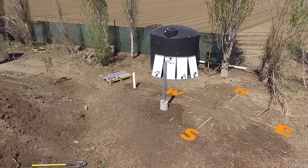We're ready to drop our well pump down our well. If you're installing by yourself, I recommend stretching out the drop pipe and pre-taping the wire and the low well sensor every 10 to 20 feet along your drop pipe, leaving some slack in between. That's important because poly pipe is going to stretch around 1% — over a hundred-foot drop it might stretch around one foot — so we want to make sure there's a little extra wire slack so if the poly pipe stretches we're not pulling on our wire or our splice. If you're installing with multiple people, one person can lower it around 10 to 20 feet and the second person can do the taping.